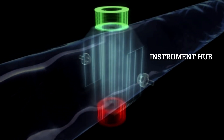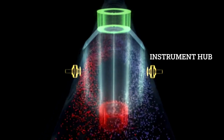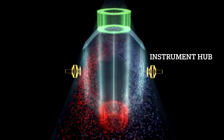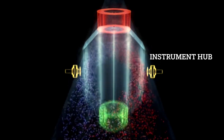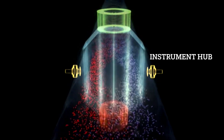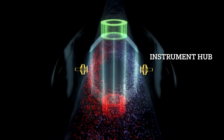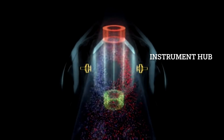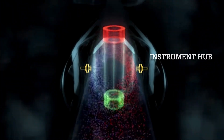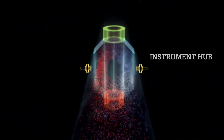The electrodes also detect what is called interference voltage, which has to be separated from the actual measuring signal. One method successfully used for this purpose is to create the magnetic field with a pulsed direct current. The polarity of the magnetic field is alternately reversed — illustrated here in slow motion. The voltage picked up on the measuring electrodes now constantly changes in polarity. As a result, all constant interference voltages — for example, electrochemical effects in the liquid or external electromagnetic fields — can be eliminated, and they have no impact on the actual measuring signal. The advantage of this is a stable measurement.